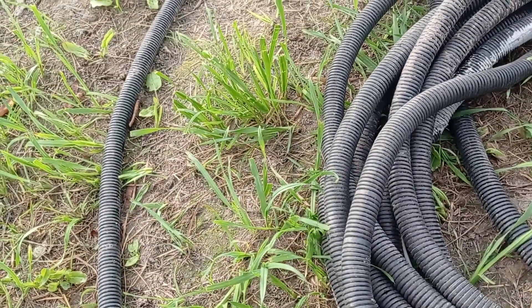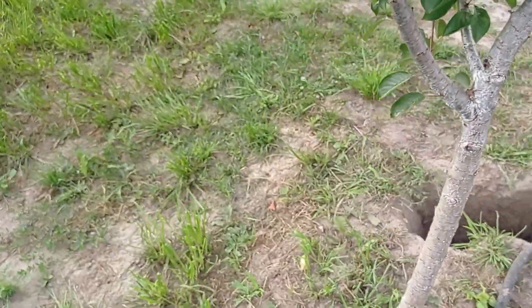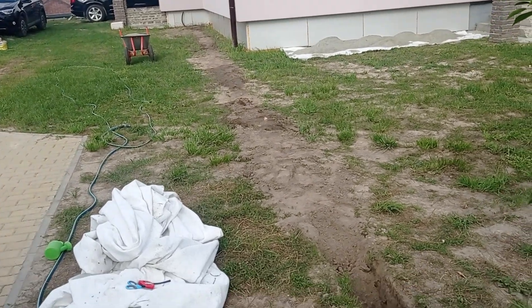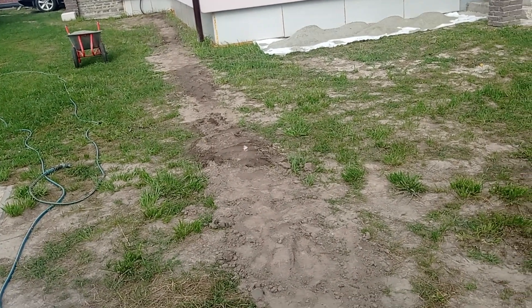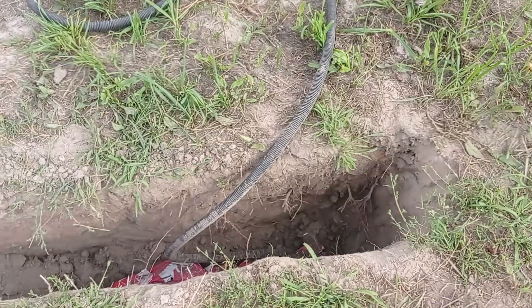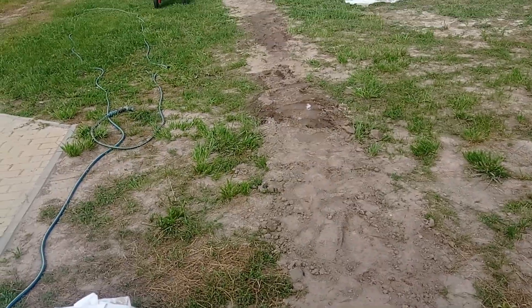This will be the short update for today. I will probably need another day to get it all out — from here to that place took a nice amount of time. This is the third day I'm doing this. I have to apply water inside to fill the trench, and then fill in the soil so it compresses really heavily. I have no soil waste at all — everything that was inside I put back down, but I still have a hole, which means I'm missing soil. I'll have to add a little to reach the same level. This means the compression before was not enough, and right now I'm doing it in a much better way.